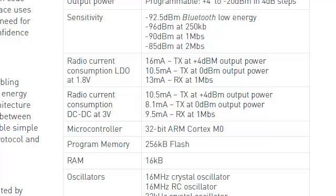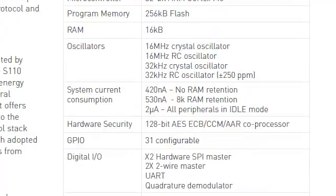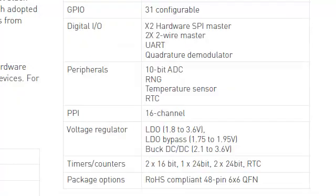With a built-in DC-to-DC converter at 3 volts, it's able to achieve 10.5 mA at 4 dBm power output. It has the ability to wake on button presses or some external stimulus as low as half a microamp. It can run its real-time clock at about 2 microamp and wake up on intervals. It has a built-in temperature sensor and a true 10-bit ADC. Its input voltage range, employed by the RF-DUINO, is 2.1 volts to 3.6 volts, with a nominal at 3 or 3.3 volts.